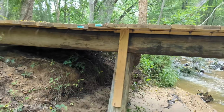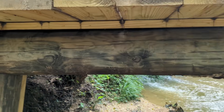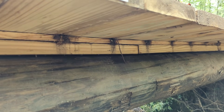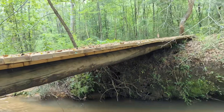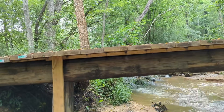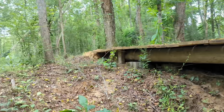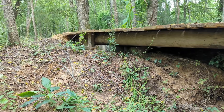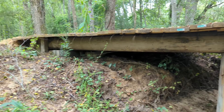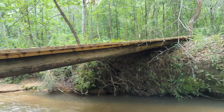Because the poles are kind of uneven and not exactly straight, I had to come in and put a two-by-four and a one-by-four in places to make it level so I wouldn't have bumps and ridges across the decking. The four poles were also four different lengths, so I finished out the ends by extending them with some four-by-fours, spliced together — trying to do it on the cheap using leftover four-by-fours from another project.